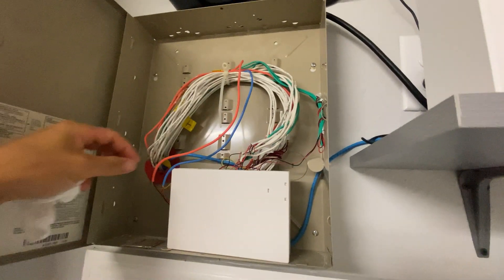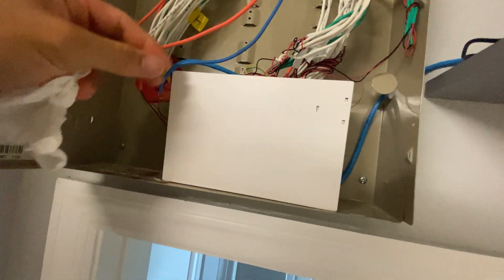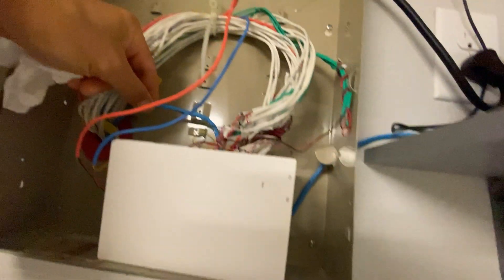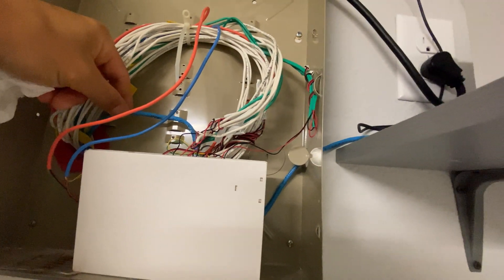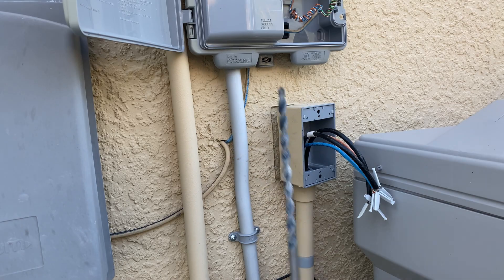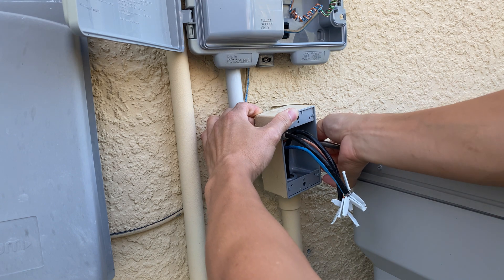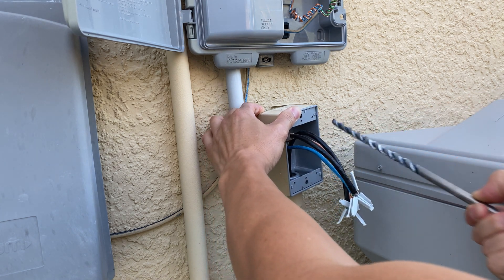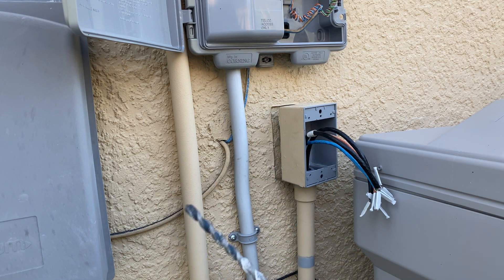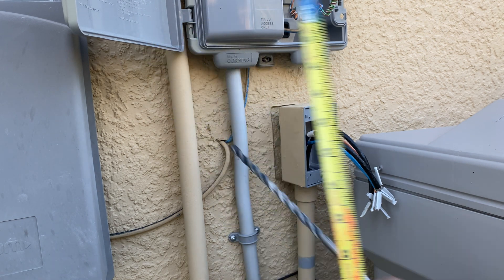In the security alarm box, the alarm has one orange wire going into it, then a blue wire — but it's not the same blue wire we found outside. That other wire goes back to the box upstairs in my switch because I'm using it as a backhaul for my mesh network. I've got my long drill bit here for cinder block. This house has eight inch cinder block or concrete block construction, plus a layer of stucco on it. I'm assuming it'll be about eight or nine inches — turns out it's nine inches, so there's about an inch of stucco on this wall.